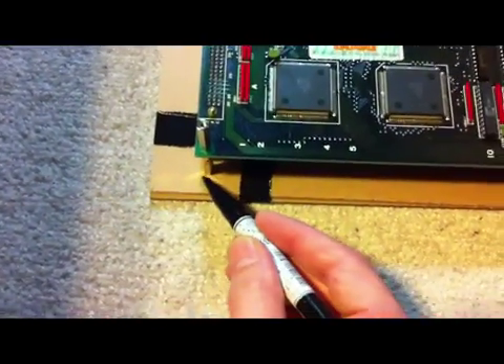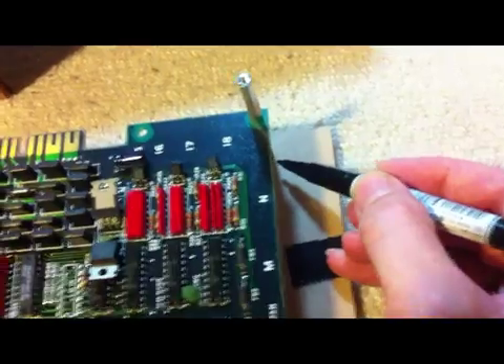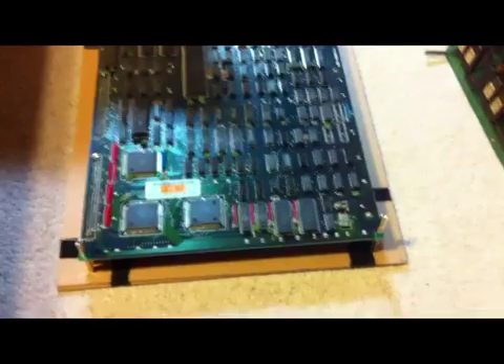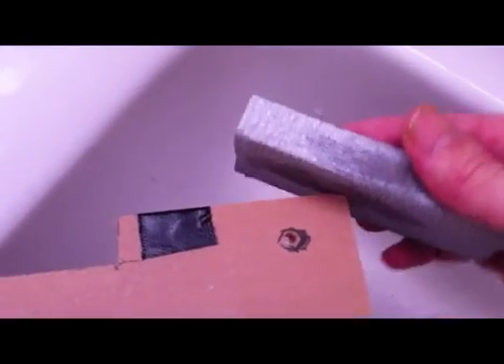You place the PCB on the plexiglass again and then you need to plan the holes — where you're going to drill. So you mark around the spacers exactly where the holes are going to be. I have four spacers and I'm going to add three more holes. Some holes are based on the spacers and some of them are going to be loose — just for extra structure.